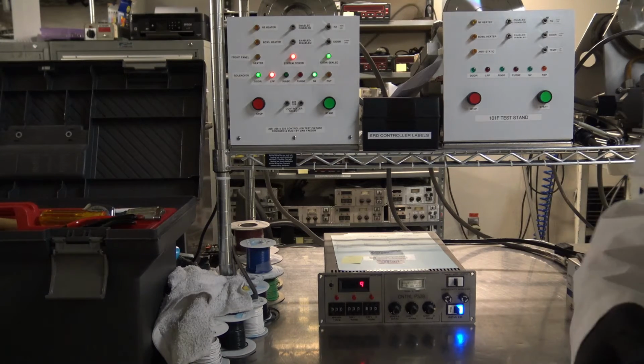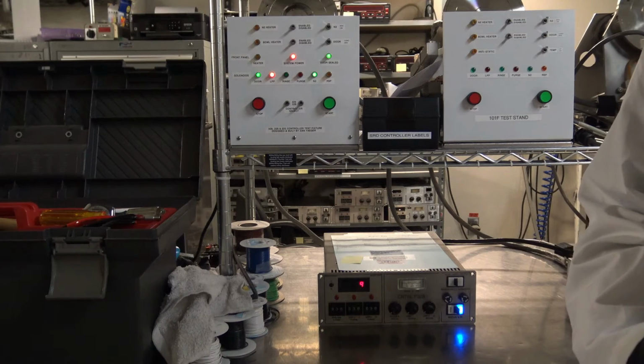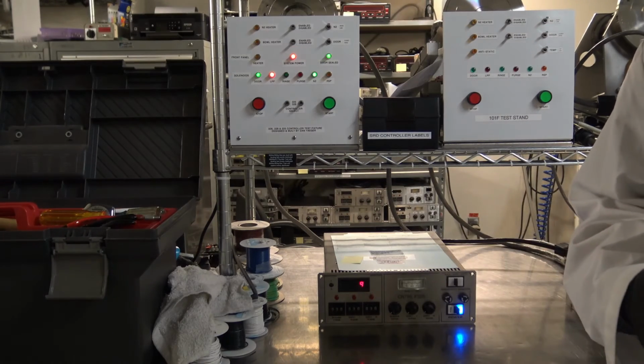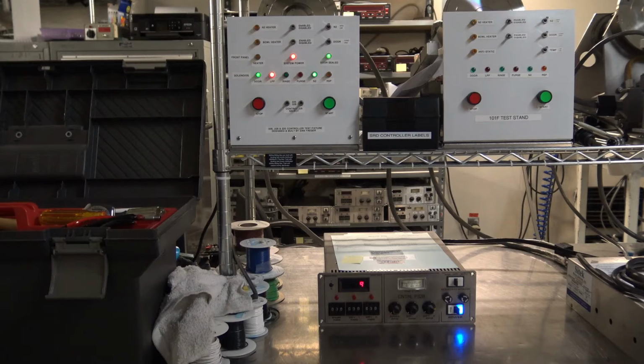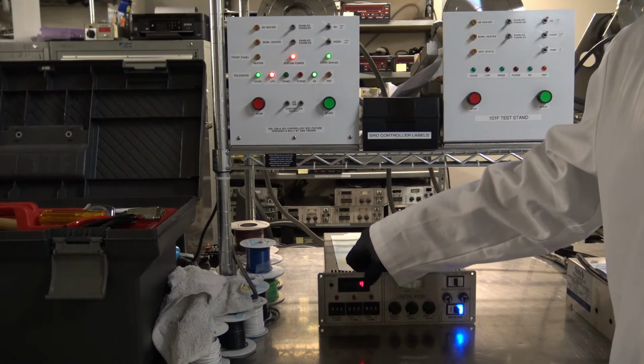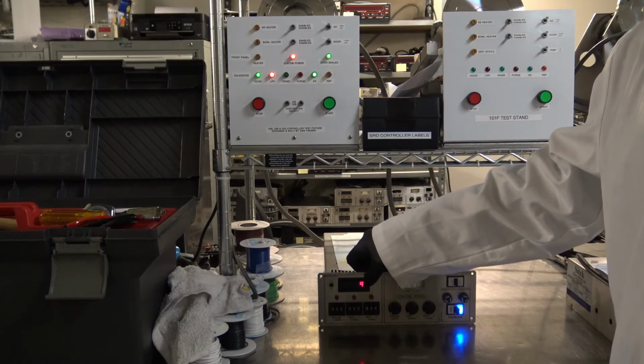So this is a 1-minute delay after the end of the cycle. That could vary from controller to controller due to the software in this 328 controller. We're going to be sitting here for about a minute with this 9 here that shows that the RSP is awaiting to fire.